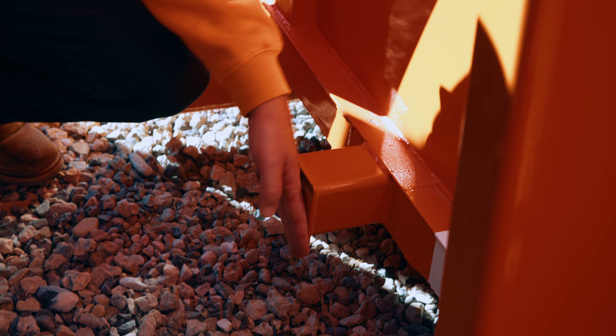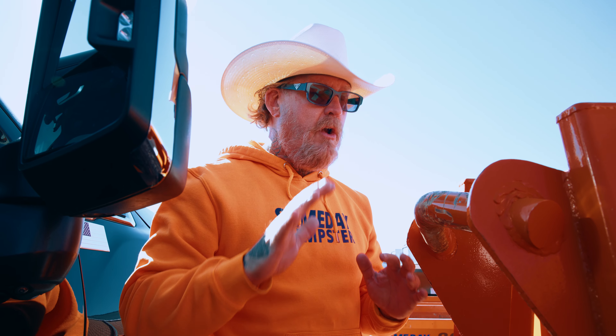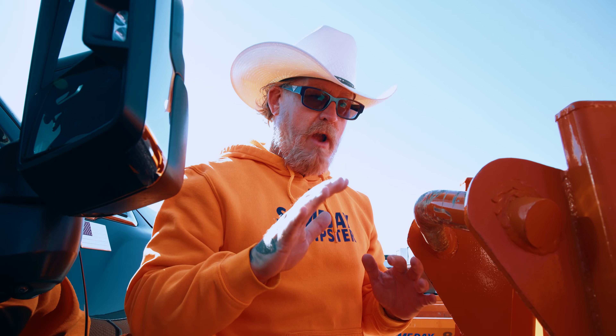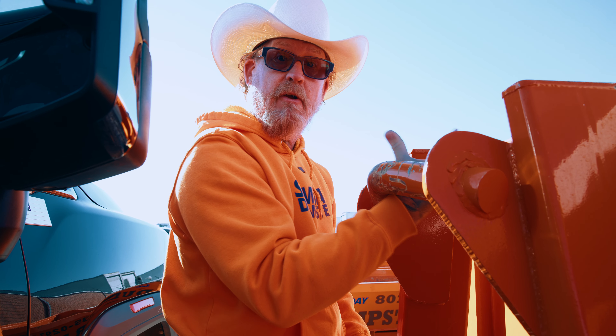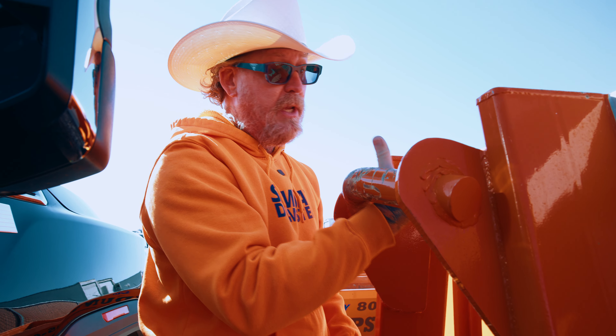If you have a can with one of these bumpers, it does the same thing. If you don't have the plate behind it and you don't have this bumper on the bottom, the hook comes off. Now your jib's caught in there and when you go to lift it up, it won't lift the can. Now your can is wedged on your jib.